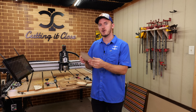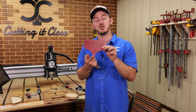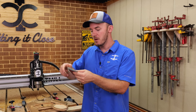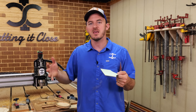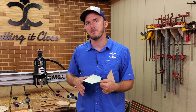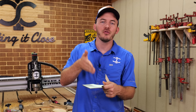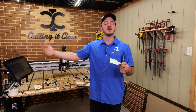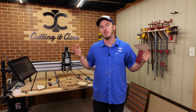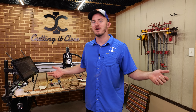Here are the most important tips regarding point cutters. One: it does not actually come to a point — the pointier it is, the more fragile it is, and most point cutter bits will be a little bit dull. Two: do multiple passes because this bit removes a lot of material; 45 to 60 inches a minute is a good feed rate. Three: they cannot be used for pocketing or any other toolpaths — Profile on the line is the toolpath you need. If you don't want to create your own form tool, just download the tool database from cicworkshop.com. Like and subscribe if you got value, and as always — you ain't cutting it close, you ain't cutting it right.